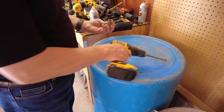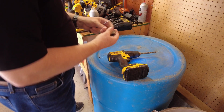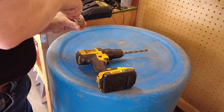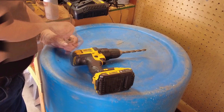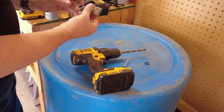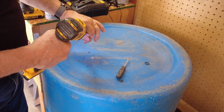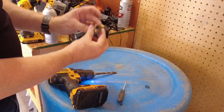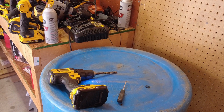This is the old one. All it's needing is an O-ring in there. It needs to be cleaned up because it's kind of corroded. So I'm going to take the O-ring out that I put in there, which was obviously too big because I see it wasn't fitting right. I think that got pinched. Anyways, that's the first thing. Second thing was the hole. It's kind of corroded. So it was getting rusty. Looks good now. And let's take a little wire brush to it.